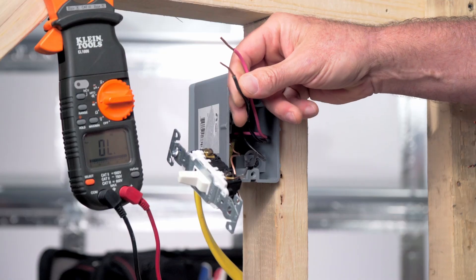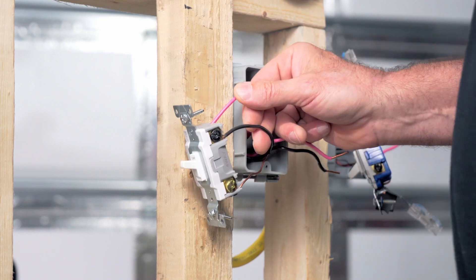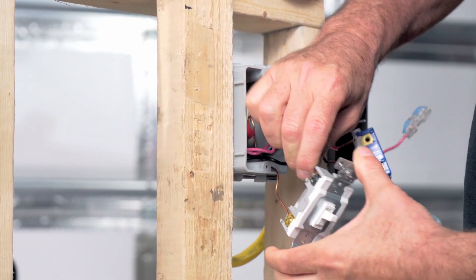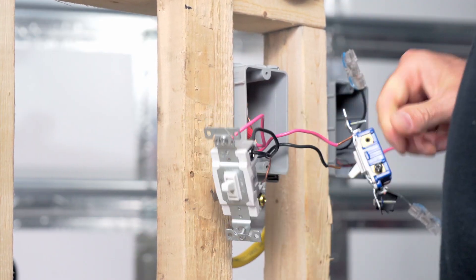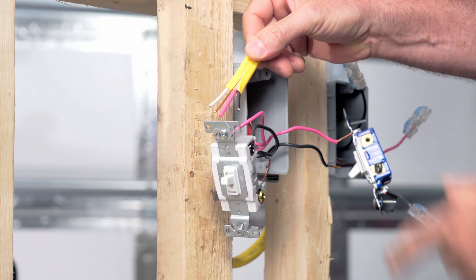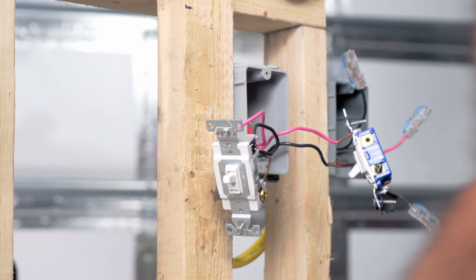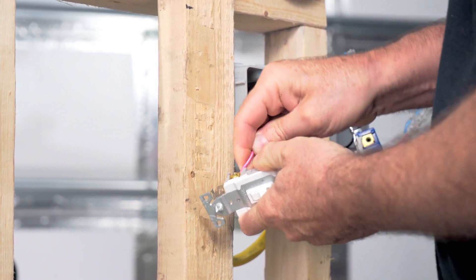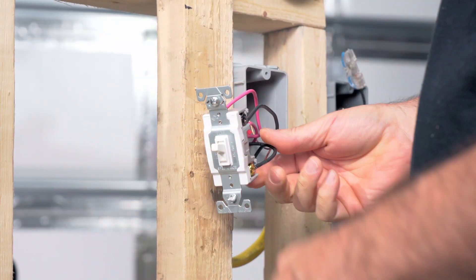These are our two travelers — I'm going to tighten those up on the brass screws. Got that first one hooked up. I've taken the set of travelers we just isolated and put them on the black screws — there's a black one and a red one on the black screw. Make sure you don't get your travelers mixed up; you don't want to take a black from one and a red from the other. Look inside at the sheath so you know these go in the same sheath. Our other set of travelers go on the brass screws going to our third switch. Set one and set two — that's it. There's no other mystery to a four-way.